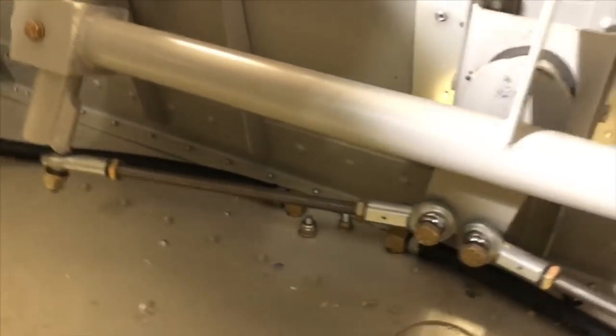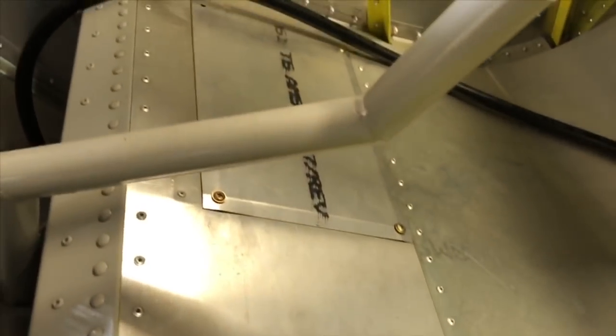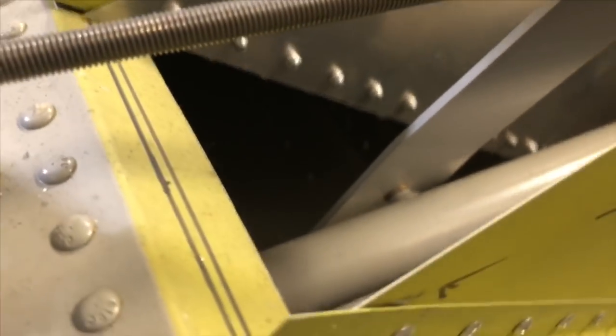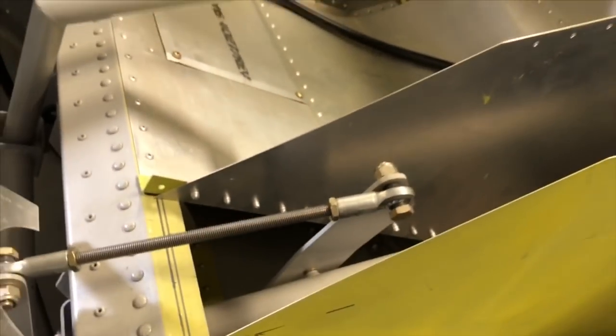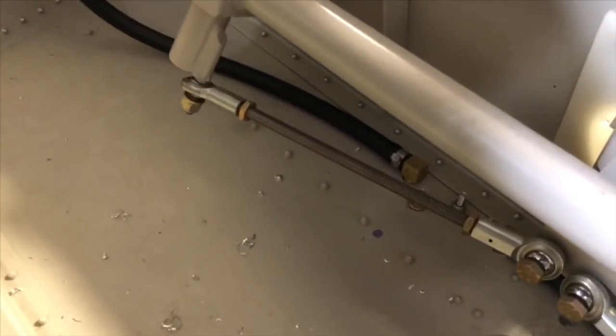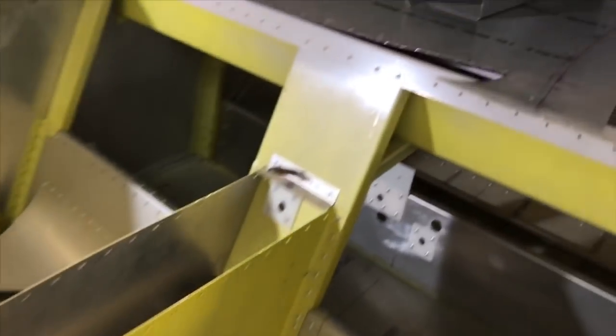The other hanging or attach bolt for the header tank is down inside this cover. Take the passenger seat cover and then it's over in this area — that's how you support the tank. Then of course you need those two brass elbows, and other than that just run your hose right to it. If you're going to put low-pressure filters there, there are some filters built into the pump units, but having additional filtration through some low-pressure fuel filters wouldn't hurt. Of course, if you can fit them in the wing root and not inside the airplane, that would be nice.